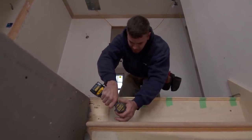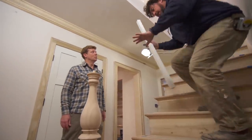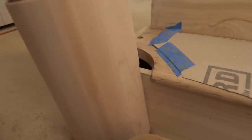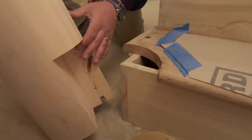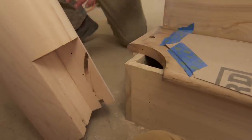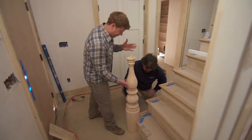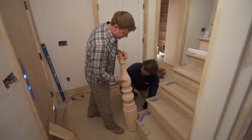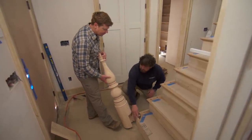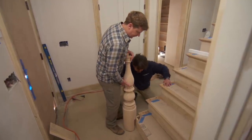So handrail today? Handrail today. We're gonna set the newel, get the handrail up top going. The staircase itself went in in about a half hour — that was fast. You expect the handrail to go as quickly? I do. We got a lot of this stuff from the factory. We've already set the top newel. We're gonna get this bottom newel in, the rail, and these balusters. As you can see, they've already notched out this newel and cut out this tread. This is all stuff we'd have to do if it didn't come from the factory — look at that perfect fit.